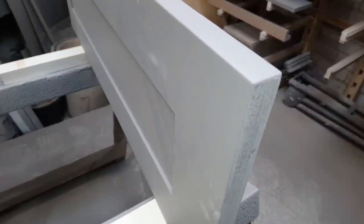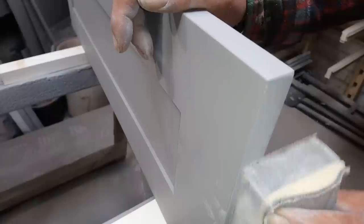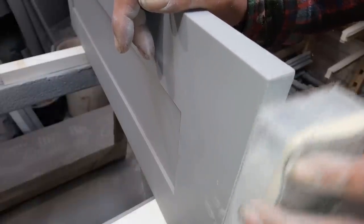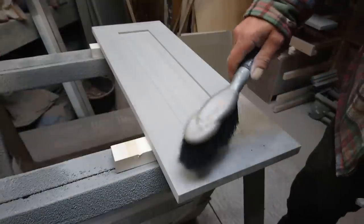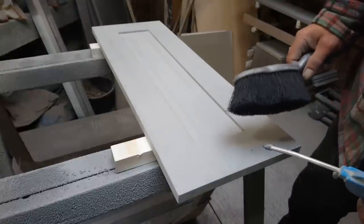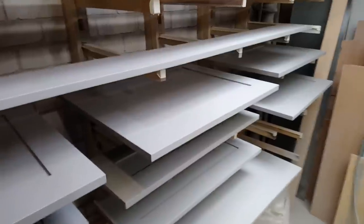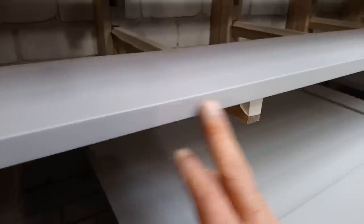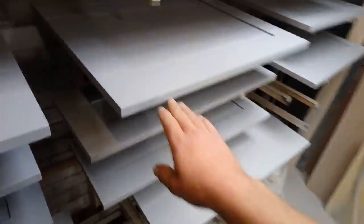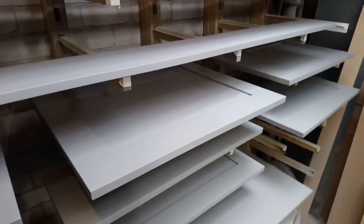You can see on the MDF edges where you haven't sanded. Now although it's been sanded and the dust is loose, it still sticks even when you blow it off, so I'm using a clean brush. That's two coats of primer on everything - the edges are nice and smooth now. I'll give them a quick rub over with the 320 just to remove any little nibbles, but I won't sand too hard, and then we can get some top coat on.